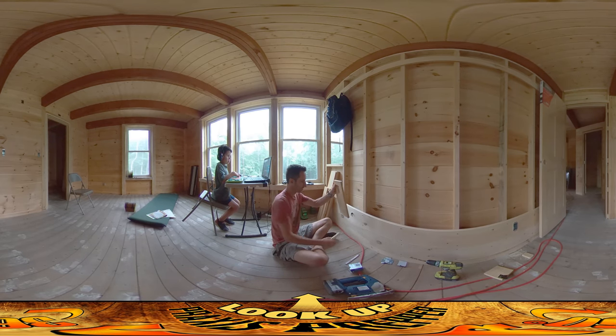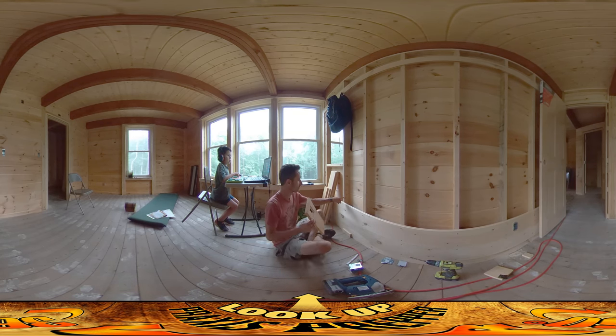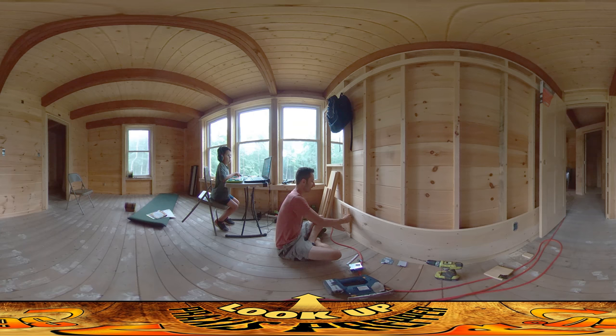If you put in the outlets in this room, use this template with a two-inch space underneath. You want to keep it closer to a stud than being right in the middle, because if it's right in the middle it's not close enough to get the wire stapled. You're supposed to have no more than six inches of space — you can staple in the box in this case.